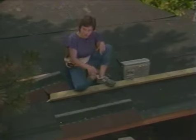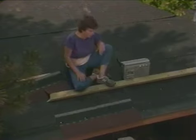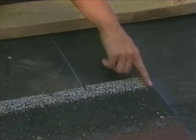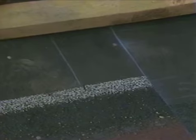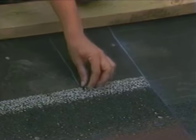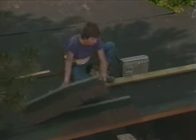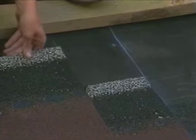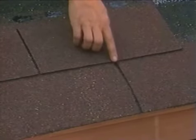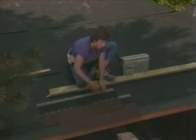Now we place our shingle at the bottom, directly on top of the starter row, so we'll end up with a double layer of roofing material. We place it near the middle. Then we run a chalk line up the edge of one side of the shingle all the way up the roof. Then we snap another chalk line parallel to the first, extending from this small cut mark at the top of each tile. This line becomes a guideline for our next shingle. In this way, we'll get an alternating tab pattern across the roof. Then we use the top of these cut marks as a guideline to lay the edge of each tile above.